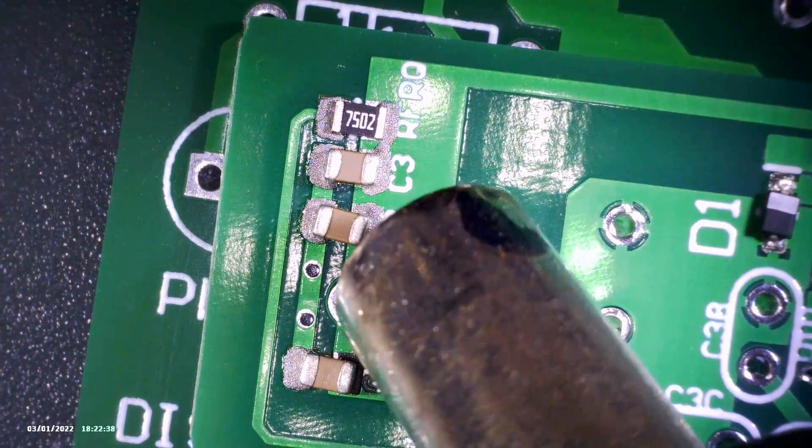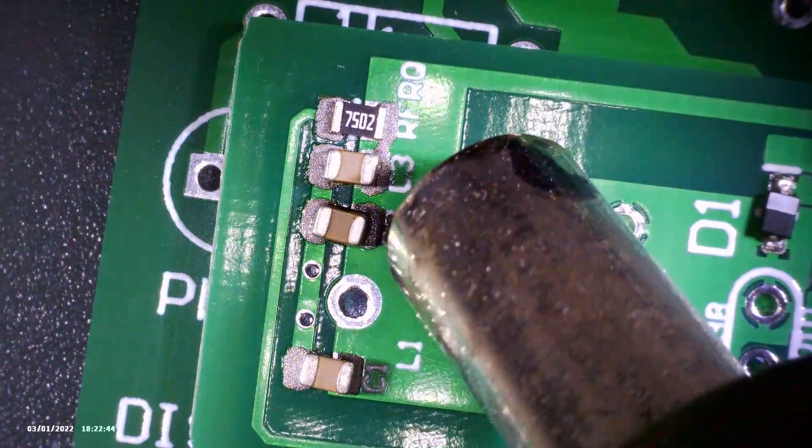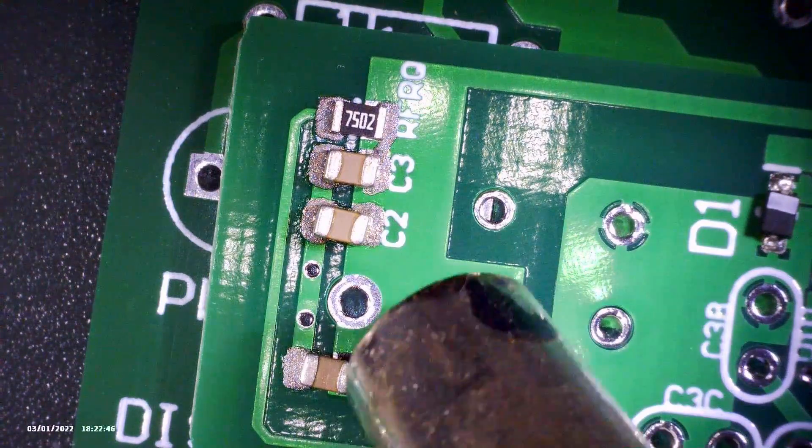I've found that it's fairly easy and I haven't run into any problems doing it this way. This is actually the first time I've ever ordered or used a solder stencil for a home project. I got it because I'm using a really tiny package for all the flip-flops, and I wanted to be sure to apply the right amount of solder to them to avoid any issues. Unfortunately, my camera couldn't focus properly with the reflective surface of the solder stencil, so I apologize for the blurry footage. This stencil didn't require any special work for me to create — I just had to request it. It cost me about $20 total to order 5 boards and the stencil from JLCPCB, and I ended up getting them delivered 23 days after I ordered them.